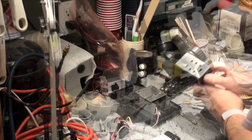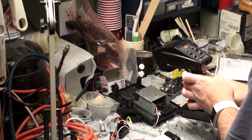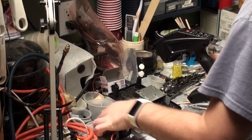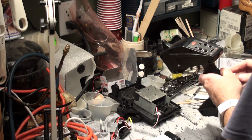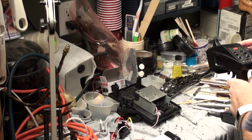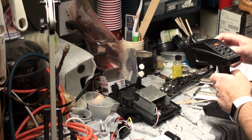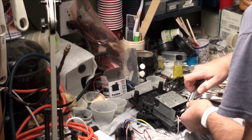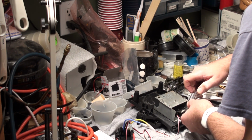To do this, the servo is connected to the receiver, which is also connected to the speed controller, which is then connected to the NiCad battery, which has been charged. The radio control unit is loaded with fresh batteries, turned on before the speed controller is turned on, and the steering servo is moving. Next, I had to fabricate an arm to connect the servo to the steering gear.